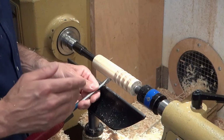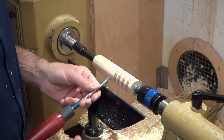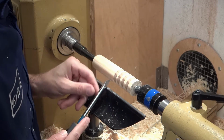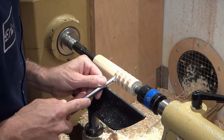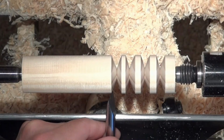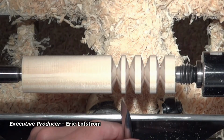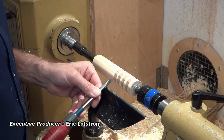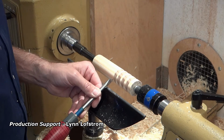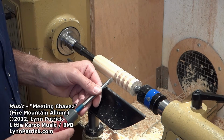You may have noticed that the Vee cut is a really nice transition from the paring cut. The Vee cut, we add one more variable. So instead of just paring and steering one bevel all the way down the face of the end grain, we now angle going one side and ending vertical with the edge, and then repeating from the other side. This is a great exercise in your ability to create a symmetrical feature, going on the right side and then going on the left side and repeating the mechanics for both sides.